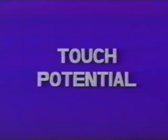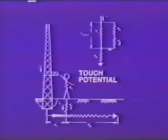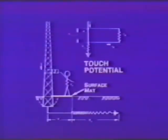Touch potential is just another expression of the same problem. A man standing on the earth in contact with the structure represents an alternate path to ground. In the event that a fault current were to flow down that structure, there would be a voltage drop across that man, there would be a current flow through him. It essentially has to be dealt with the same way.